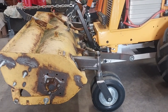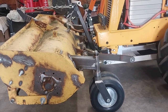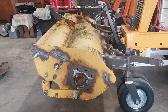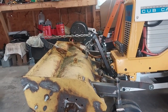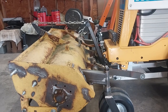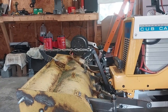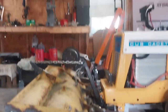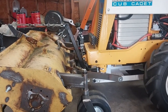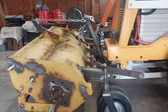The wheels are back behind the lower pivots. What happens now if the wheels go over a bump or up a hill — the front of the mower dips down and it's basically pivoting around that front pivot, and it's kind of trying to over-center everything. I think of it like a pair of vice grips. I'm pretty certain that's why that little eye bolt broke before — because when this goes up a hill, that puts a tremendous amount of strain on that chain and all of its mounting accoutrement. And vice versa: if the wheels go down into a hole, the front comes up, which is fine. But this is all backwards.